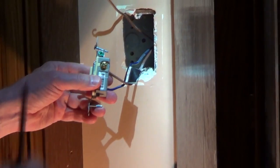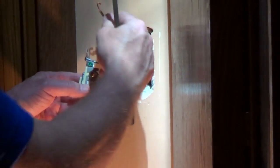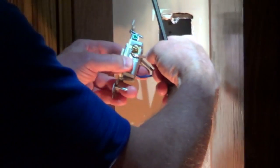Here in the Chicago area we have metal conduit going all the way back to the service panel, so many electricians do not use a grounding wire because everything is grounded back to the service panel via that metal conduit. But if you do have a grounding wire, you would connect it to the green screw.